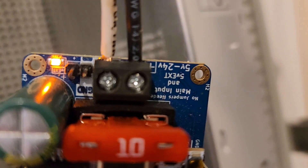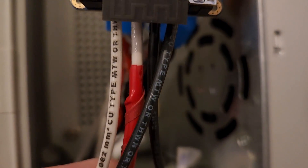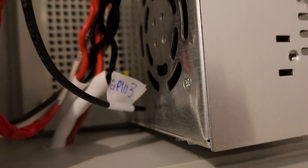I used 14-gauge wires to connect the power supply to the controller. The controller power outputs were connected to the three-wire cable to the first string of lights as well as the power injection wires. The data output from GPIO16 was connected to the data line, and I added a spare wire to GPIO3 for my garage doors.